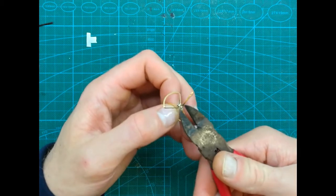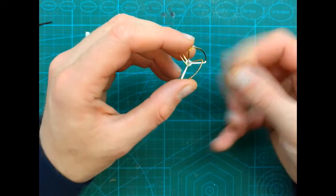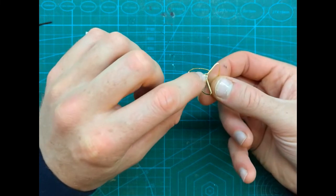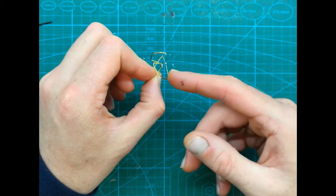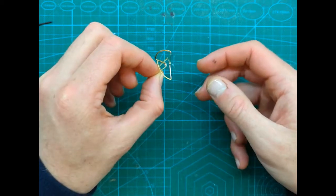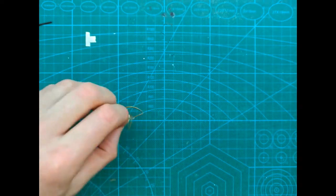What I did was just snap from both sides, and actually there is a little bit left here on the top to be removed, because we need to have two holes, 1 and 2. So I'll show you how to do that. Basically, if you're a beginner, the best would be just to cut these bits out and unsolder one by one. So you just cut those ones in the middle, this way, 1, 2, 3, and then what is left you can unsolder, and this is how we do that.